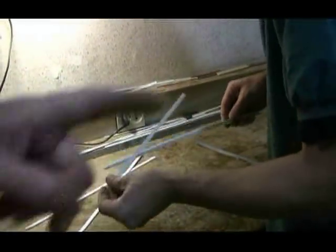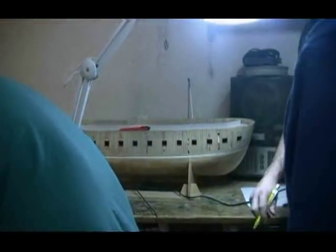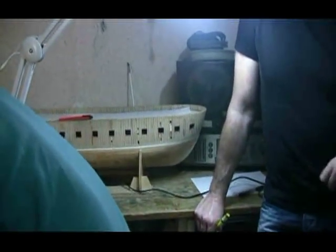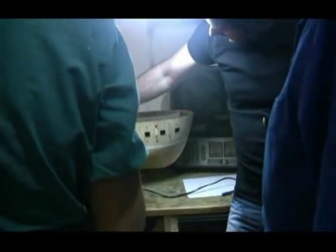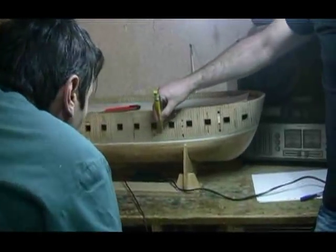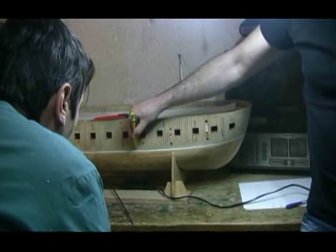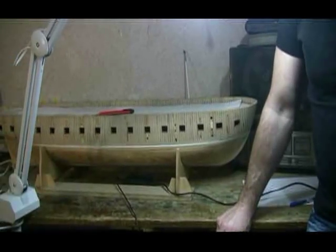Can I just ask a question? What happens if one of the points that he marks on the smooth line does not fit with the rest? He has here many marks for the top of the main wale, a smooth line. What happens if one point is up? You must check your calculations on the paper.